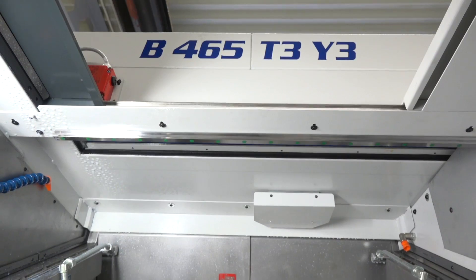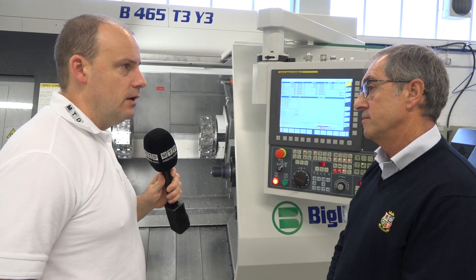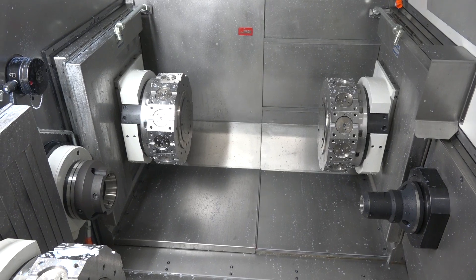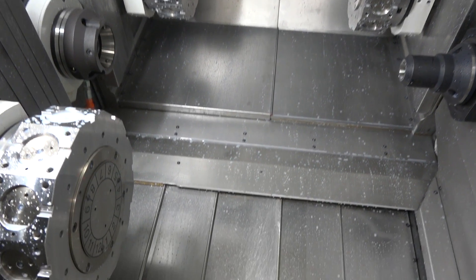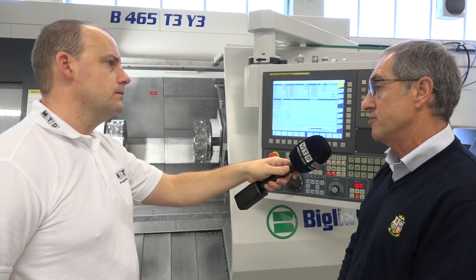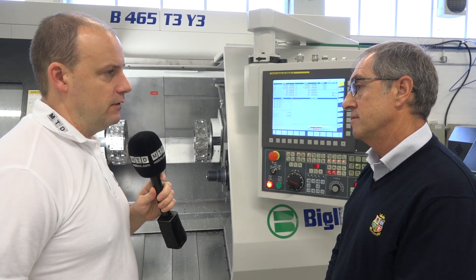The space inside this machine shows a lot of attention to detail, with quite a big capacity turning diameter and turning length. It's a very robust machine with a heavy-duty casting and a 30-degree slant bed, designed for hard turning applications as well as more conventional commercial work. That leads on to precision — we've spoken about the complexity of parts and productivity, but how does it achieve the tolerances that manufacturers might be chasing?